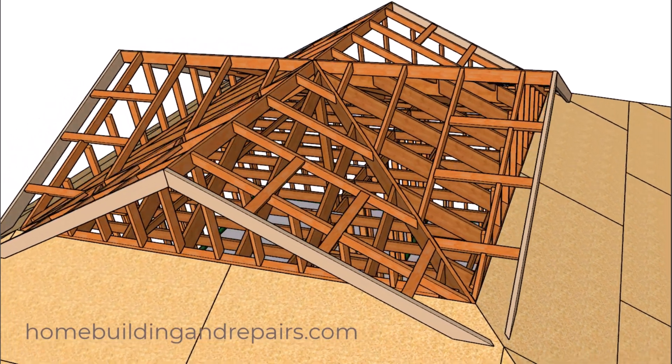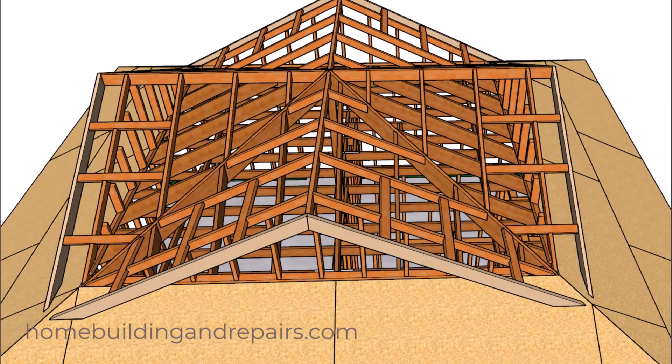Something like this can be built on top of the roof sheathing if that's easier — install the roof sheathing all the way up to the top, but make sure that there are holes cut in the roof sheathing underneath the Dutch roof framing for ventilation. You've got to be able to have air circulating in this area.